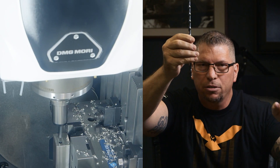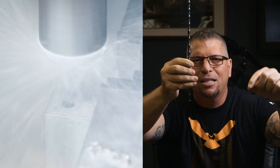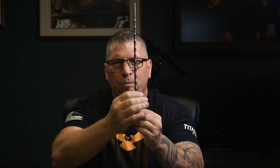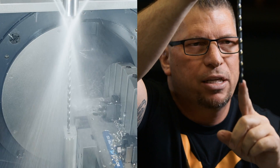I'm not going to go into all the details and variables of deep hole drilling — if you want to know that, watch the other video. I'm simply going to give you the code. We're going to start at Z 0.1; XY is zero and it's centered perfectly over the pre-drilled hole. In the other video, the pilot drill went down Z negative 1.2. The pilot drill was the same diameter but the tolerance was on the plus side, and the tolerance on this deep hole drill is on the minus side, because we don't want any rubbing. So we're at Z 0.1, ready to drop into the hole.